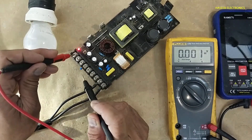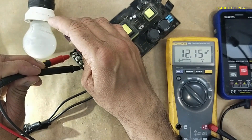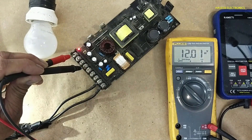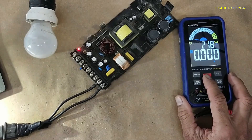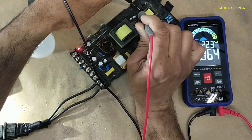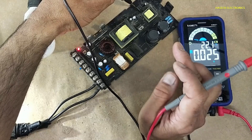Now the LED is turned on. If you check the voltage: 12.21 volts. So the IC is controlling the voltage — it's good. Now we need to check the voltage on the VCC pin of this IC, pin number 5 and 7: 11.42 volts. Reference voltage: 5 volts. Before this, when the IC was short-circuited, it was only 7 volts and there was no reference voltage.